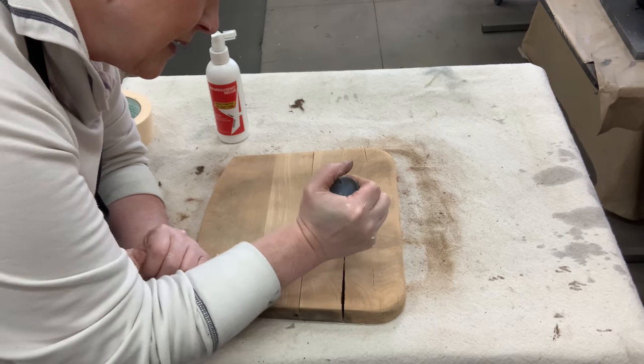This is something I have definitely learned over time. When it comes to this type that has that paper, if you try to sand the paper off, it's really hard to get that all the way down. You get some paint underneath it, you get some paper left behind. It just doesn't paint well and it doesn't stencil well. But if I seal it in with a couple coats of shellac, that kind of fills in that paper porosity, and we will be good to go.